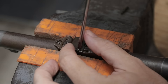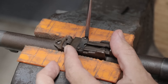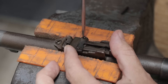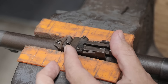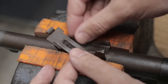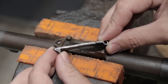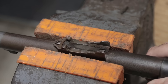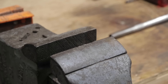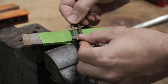I'll be sure not to lose these tiny screws. To reform this, I'll be using the vise to squeeze it flat again. But instead of the serrated jaws on the vise, I'll use these steel bars with tape on them so as to not scratch the sight.